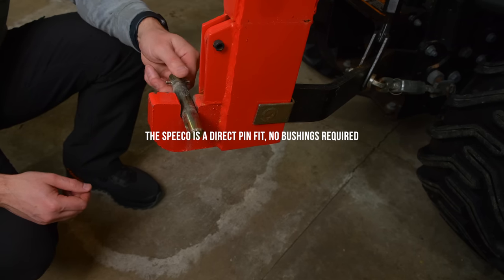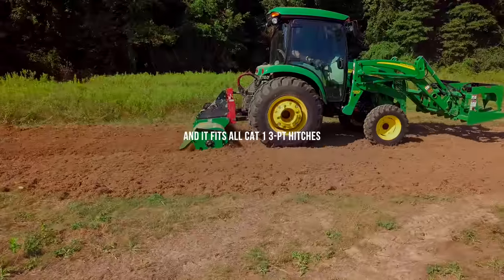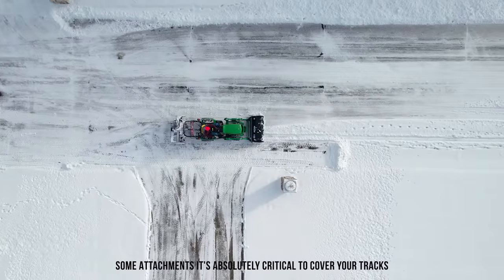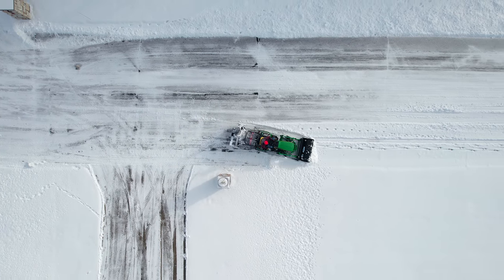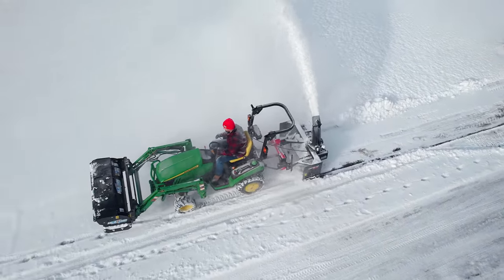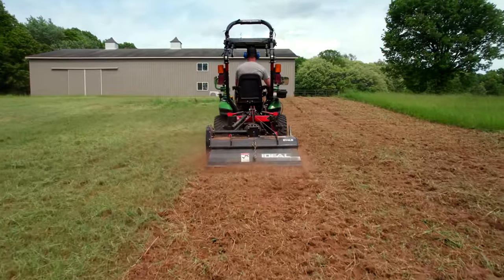A 54-inch snow pusher is not even going to cover the tracks of a 4066, let alone have enough support and bracing for the extra weight — it won't be wide enough either. It's only four and a half feet wide; a 4066 is six feet wide. Same thing with a snow blower or a brush hog — four foot on a 1025R, six foot minimum on a 4066. If you're going from one end of the spectrum to the other, the chances of carrying attachments along with you are slim to none.